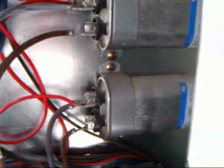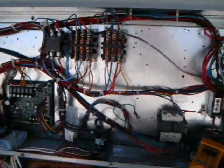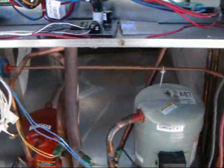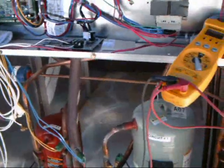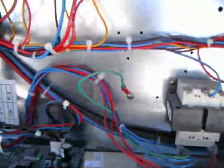They're going to discharge themselves through the motor windings of whatever motor they're wired to. On single-phase compressors - which I don't see very many anymore - it may be the same way. It will discharge the run capacitor through the windings of the compressor that's still tied between the two terminals.